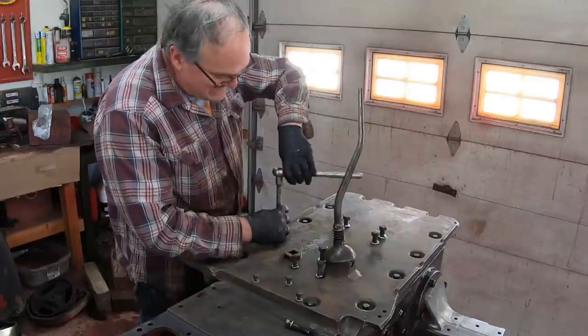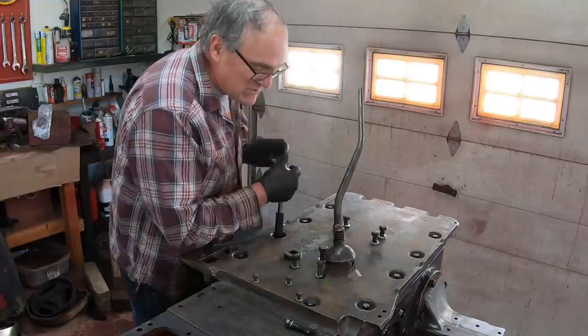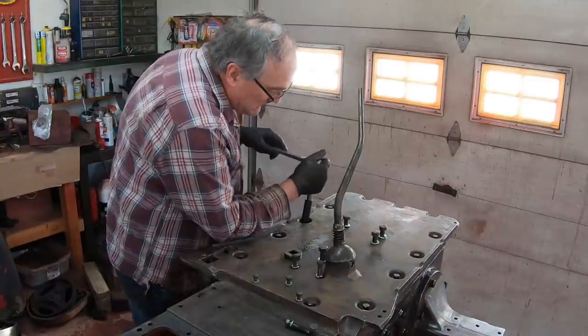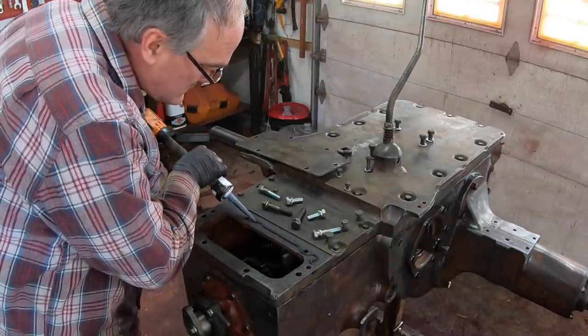You know, I have a sinking suspicion that the Permatex gasket maker, the Right Stuff that I put down first, actually does seal up the bolts because it oozes all around everything as I squeeze the gasket down, but I don't know, can't hurt. Now I can put the belt pulley blank off plate on. I'm going to use Permatex as a gasket on this one as well.